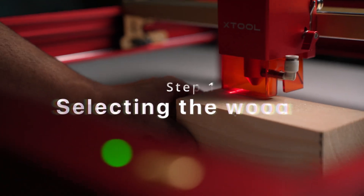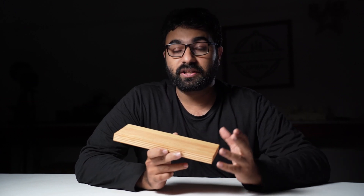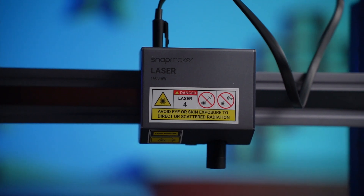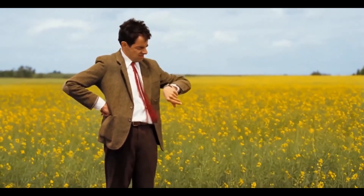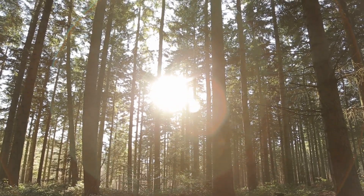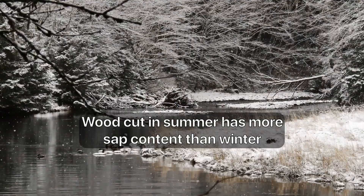The first step is selecting the wood. With some trial and error, you can get a good engraving on almost all wood. A few things to consider are the wood and its qualities. If you use a wood with too much grain, the laser will engrave at a greater depth at places with soft grains compared to hard grains. If you have a low-powered laser, use soft wood. Hard wood needs more power, and if you use a laser with less than 5 watts, your job can take quite a while to complete. If you want dark engraving, try to use wood with good sap content — the sap will burn and give you a darker engraving. Wood cut in summers usually has better sap content than those cut in winter.